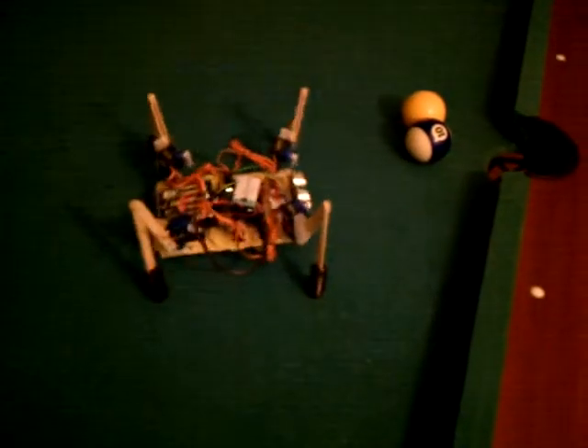I also have the sensors hooked up. He has some crude object recognition, or collision avoidance. He has an ultrasonic rangefinder on the front — I'm calling him Clyde now. The ultrasonic rangefinder basically uses ping or sonar to detect how far objects are directly in front of it. When it sees something within a certain range, it'll turn around.